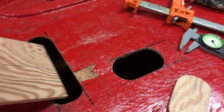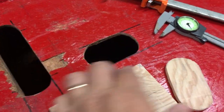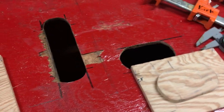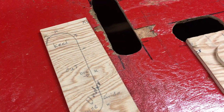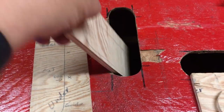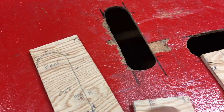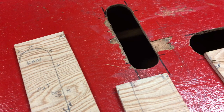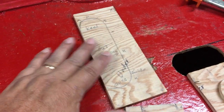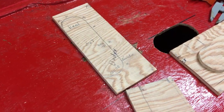We figured out earlier today we've got to put this patch in first underneath because it won't fit through that hole. So we'll get it back there, and then when it's in place from inside the hole it's going to look like that. We still have to trim this piece for this slot here, this letter box — this will be the backer plate. It can go inside and then be pulled up. We'll probably drill a couple of holes for a couple of strings so we can pull it up, then screws on each corner to hold it in, take into epoxy. Once it dries, take the screws out and fill those holes, and put this shaped piece over the top of that. A piece of poly sheeting so that whatever we put on top of that doesn't stick to the hole, and then some weights or something to hold that down while that dries.